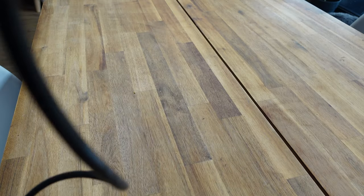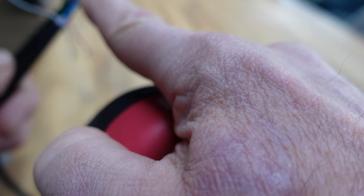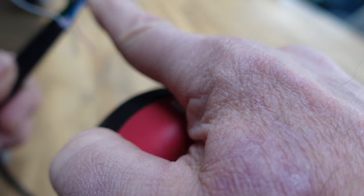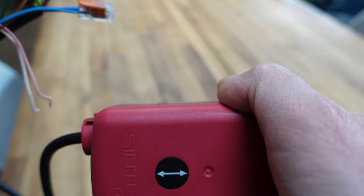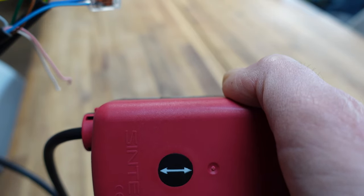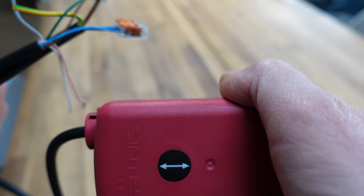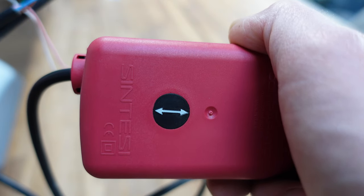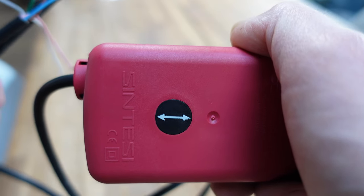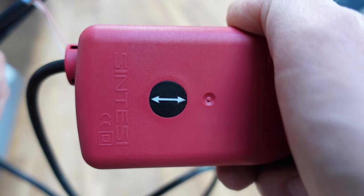The green wire is what you actually connect to the switched live — that would go to a hot water valve or hot water three port valve of the heat pump. Don't get confused with the brown and the green: the green is the switched live that needs to be connected to the hot water valve out, and the brown of the valve needs to be connected to permanent live all the time. I'm now going to disconnect the green again and it should swing back to heating only.